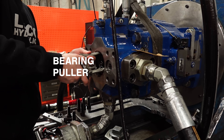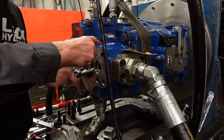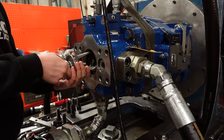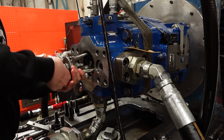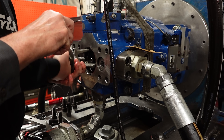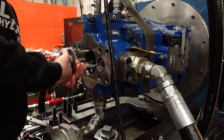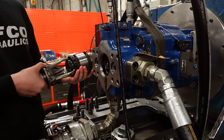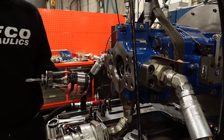John suspected there's a misalignment. The problem is either something in the block that's misaligning the auxiliary shaft. If you have something on an angle and it's loose, then it doesn't matter. But as soon as you tighten down on it and it's squeezed on an angle, it's preventing everything from moving.